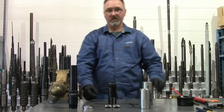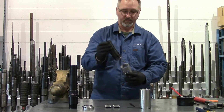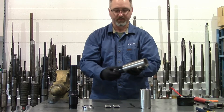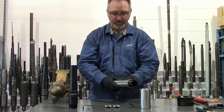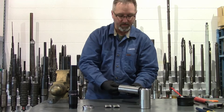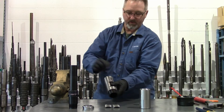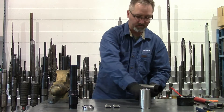To assemble it again, you take your key retainer and install your expander sleeve. I like to put my expander sleeve in and make sure it moves freely — there's nothing binding there, no burrs or anything like that on it. You take your key spring, slide it into the slot in your expander sleeve, and the little tab goes into the hole in your key retainer. Make sure they're aligned.